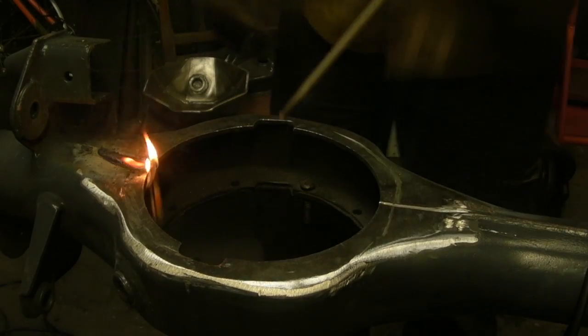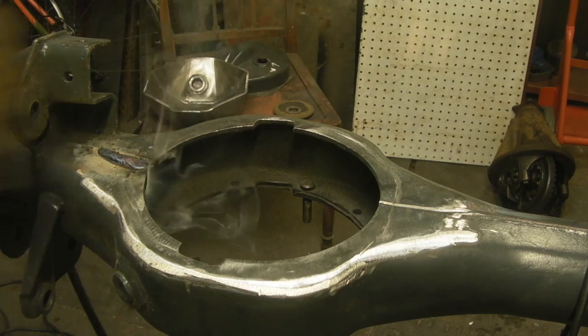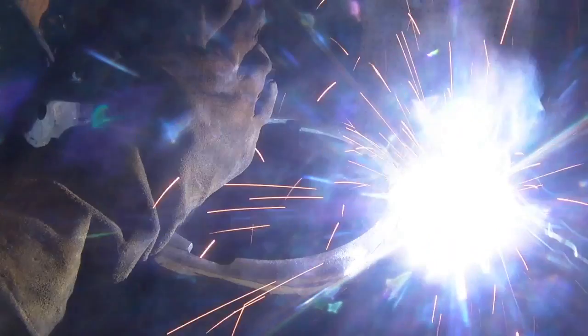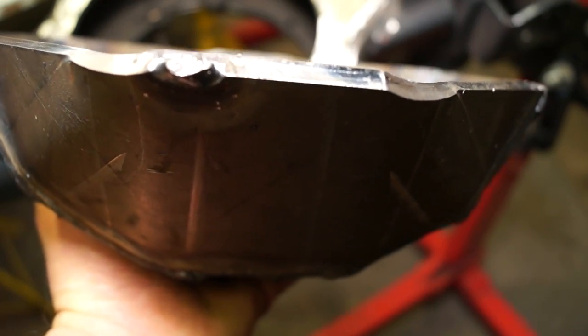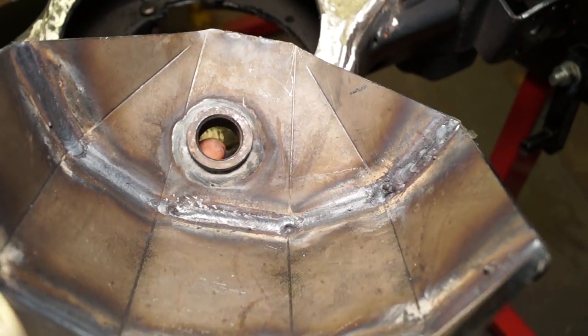Basically, we're just putting a little bit more strength into the casing. I'm not being over-enthusiastic putting too much weld down there because it will need to be ground flat. I did V it out, so where the weld goes it will stick. The pan has two extremely high spots, one either end, and I'm going to take those out first, measure it, and grind it flat. I'm not going to take too much metal off — and believe it or not, I didn't actually take too much off.